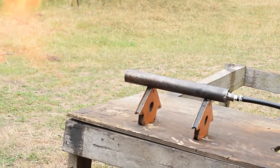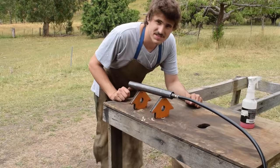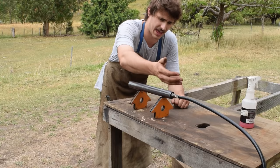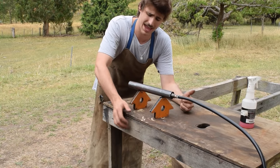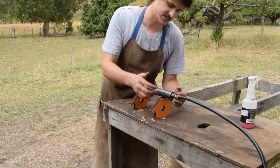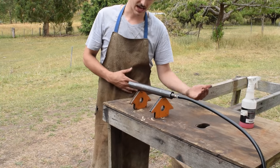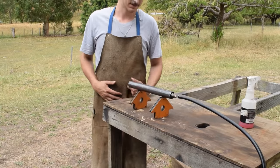The test went successfully. The flame was bright yellow, which to me indicates it's running a bit too rich. To check that, I got the air compressor and blew air through the back, and it completely changed the profile of the flame — it went blue and was roaring, confirming we are running rich. To address this, we're going to drill a set of holes further up past the nozzle, and we can also add a collar to adjust the airflow on the blowtorch itself.